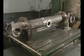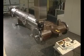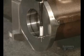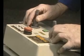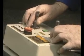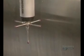Because they'll be used in aviation, these pieces have to be machined to perfection. The machining of the shaft is now almost completed. This deburring unit polishes the machined surfaces with a compressed air tool and sandpaper discs. And now they have to verify the dimensions of the parts. This digitally controlled machine has 3 axes and does the verification with extreme precision.